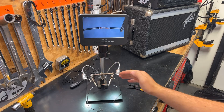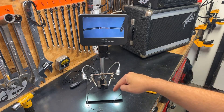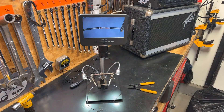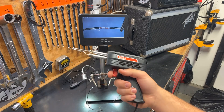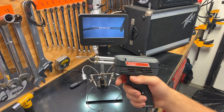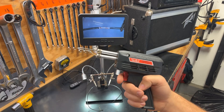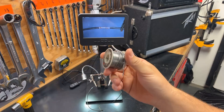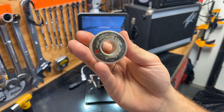I got everything fixtured in here. And like I said before, this is nicer just for use, but also it makes it really crisp and clear for you guys to see what's going on, so you can see me physically doing it and see what I'm focusing on at the same time. My weapon of choice for doing this particular job is the Weller 8200. This thing is an absolute beast. I'm sure you guys have used regular soldering pens before — that's fine and dandy for little stuff. But honestly, if you're doing stuff like this, you're probably not patient enough to let that thing heat up. I just strongly prefer these things. You squeeze the trigger and this thing gets hotter than the surface of the sun in about three seconds. So let's plug this thing in and give it a go. Before we do that, get yourself a spool of electrical solder. This just happens to be a spool of Radio Shack 60/40 rosin core electrical solder.